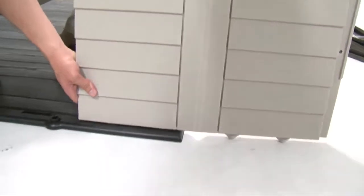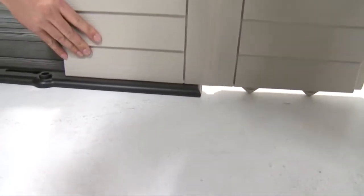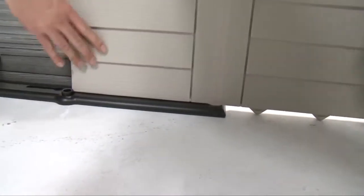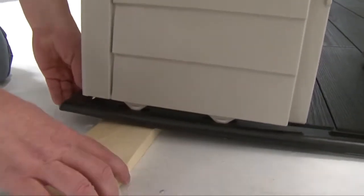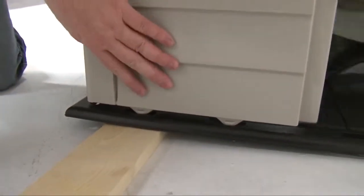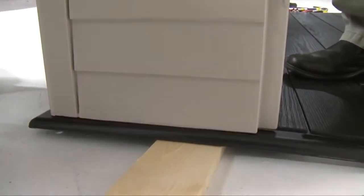Locate a corner panel and insert the tabs at the bottom of the panel into the slide lock slots, then slide the panel to the left. Bend the panel and snap the two remaining tabs into the snap lock slots on the floor panel. Note: to help facilitate the insertion, place a wood block under the floor panel directly underneath the tab being inserted. Repeat this step for each tab.